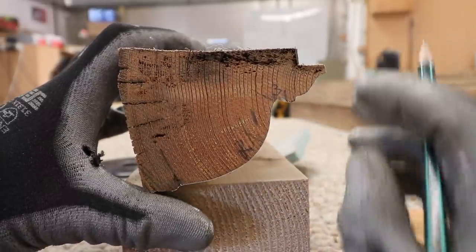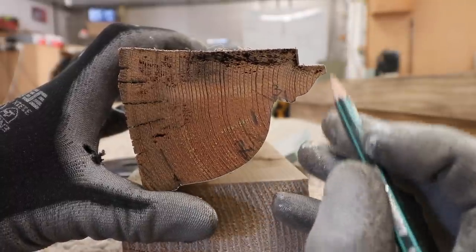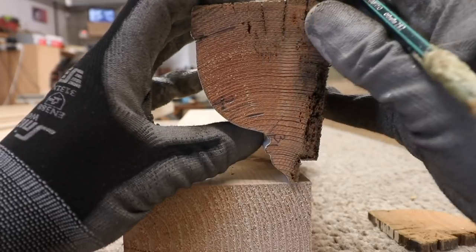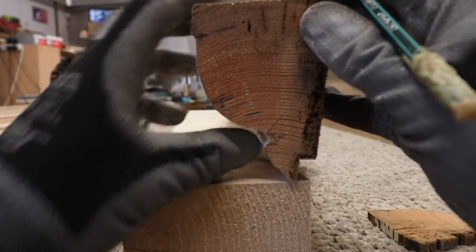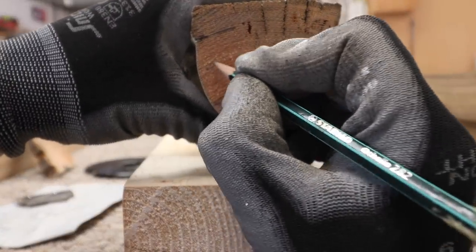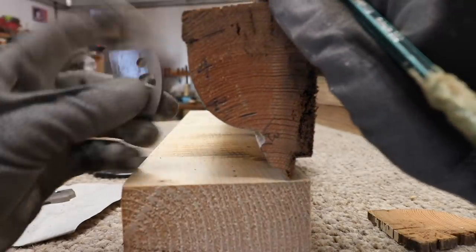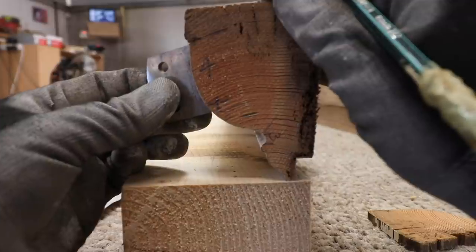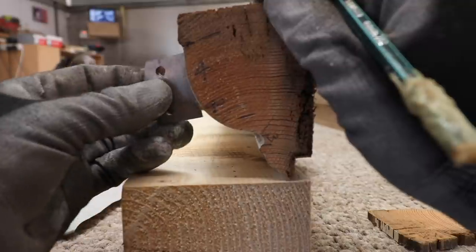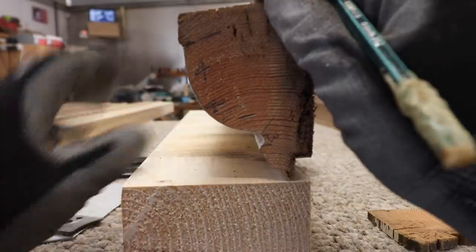Do that last. So when we've got to that point, we'll have a nice square nib here of timber. So that'll still be a square profile. We should be able to sit that on the spindle there with this square piece that's left here, and take out this last section over here. So we'll do that as cut four. That will be like that there, or like that. Probably be running that backwards for the look of that cutter, which is going to be fun. Number four.